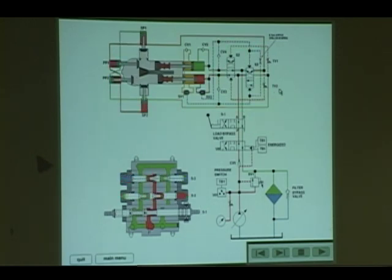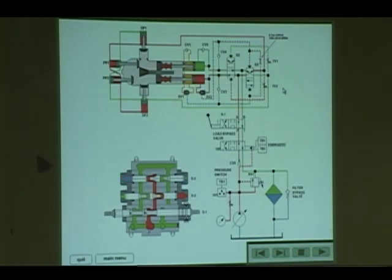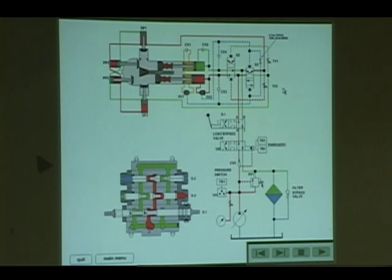Have the seals on the rams been modified to hold out longer, or just to be a better seal? Define seals on the rams. The rams, for the oil or the sludge? The sludge. They're the exact same rams. The biggest thing is, number one, keep the water box clean, and two, keep the hopper full. If that hopper runs dry, you're going to burn those rams up, and they'll be shot in a very, very short period of time.